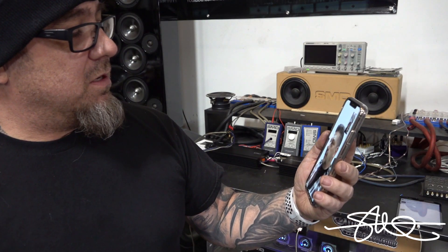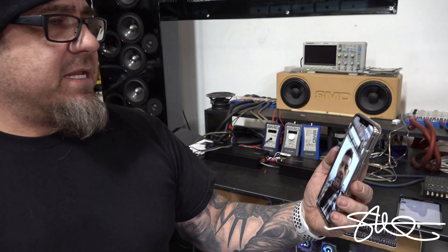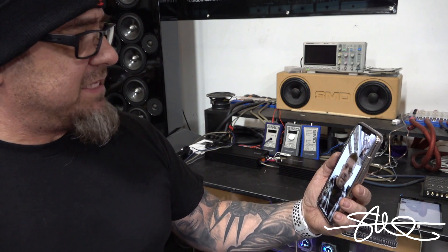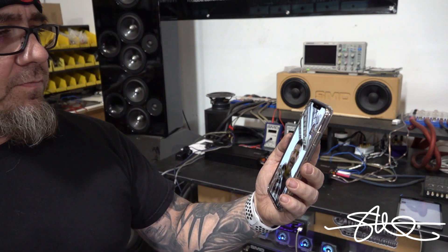I remember when we were at Knowledge Fest and you broke out an amp — an unnamed amp — but pretty much they're all going to have the same symptoms. We turned it on, and 20 feet away we had an AM radio on, and it just cut off. It stopped playing. Period. Will this amp do that? I have it right here — my little tester. This one's not doing that. Can that mess with FM signals as well? It can. So you might just think you're having bad reception, but if you have a truck loaded with Class D amps, you could be cutting off your own reception by that alone. Depending on what harmonics are coming out of the amp, you could mess up any kind of wireless, Bluetooth, FM, AM.